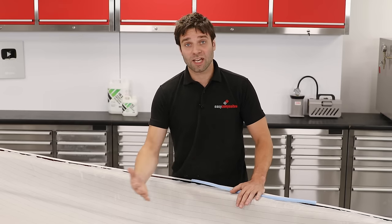Now fully infused and clamped off, the part is left at room temperature to cure. Forty-eight hours later the resin has reached its initial cure. Leaving it a bit longer reduces the risk of surface print-through or slight distortions. The consumables are torn out and the part popped from the mould. Although the peel ply finish on the inside of the boat looks great, the real interest is in seeing the moulded face.